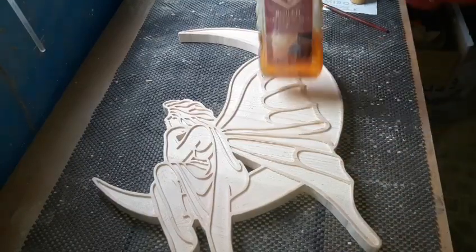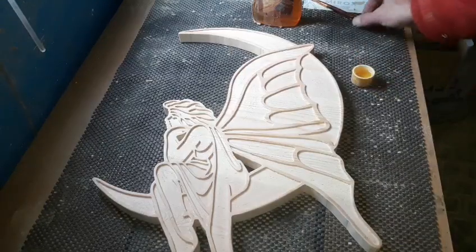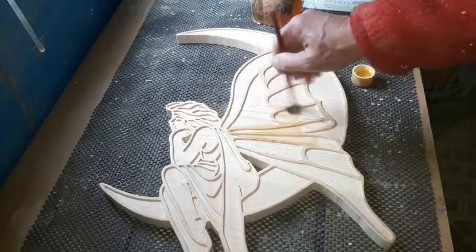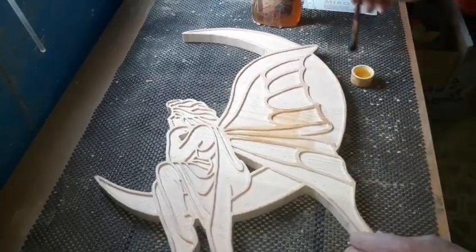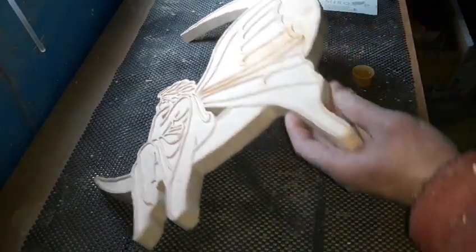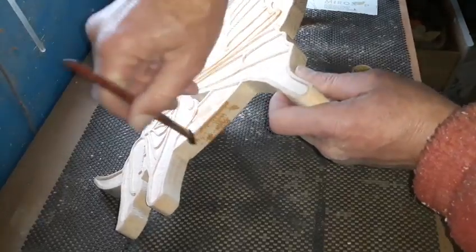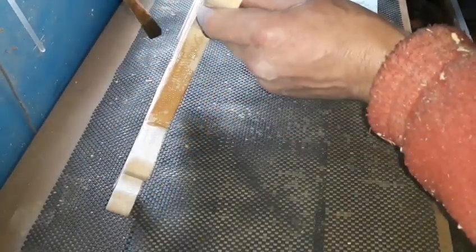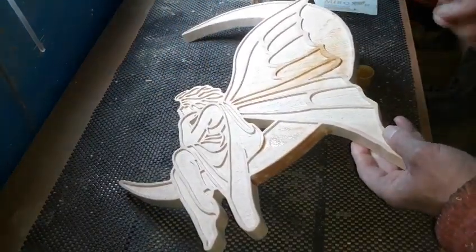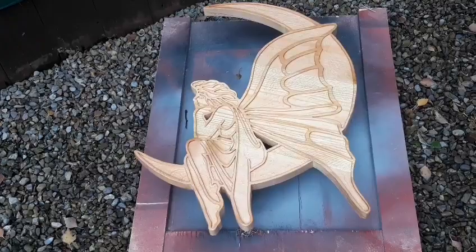Okay, so boiled linseed oil, we'll pop that on now. Just in case, again, a brush. Brushing it in, doesn't have to be too fantastic. Just spread it about like that. You see how that's darkening down already. You can get into everything, it doesn't matter. Literally just throw it on. You'll see it better on the side walls. Just get some in there. You can see how that's darkening down, look, straight away. And that's it, so I'll give this a good coating, spray on our crystal clear, and then it's resin time.